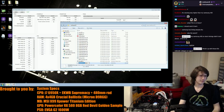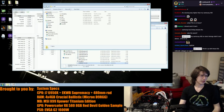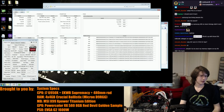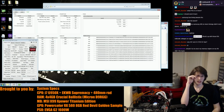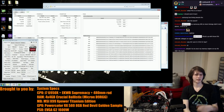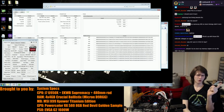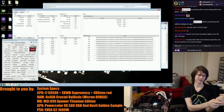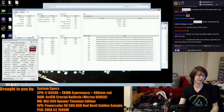Okay. Now we're going to do one more thing. Normally, if you look at those 65,000 values, I think they're addresses, not actual voltage values. I think they're pointers to the VID thing, which dynamically changes the voltage. The BIOS doesn't specify a fixed voltage, it specifies a VID range, and the card then chooses from it. I've never really looked into it that much. All I know is if you replace them with a millivolts value, you get millivolts.